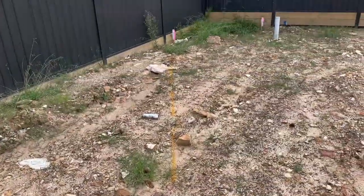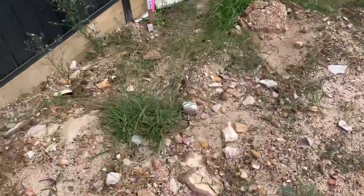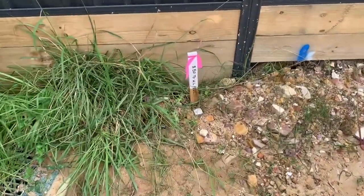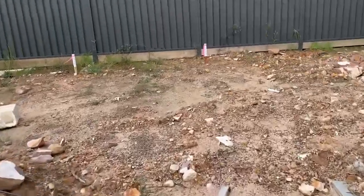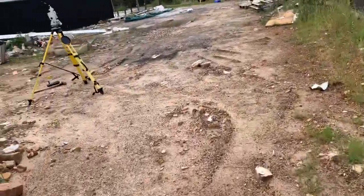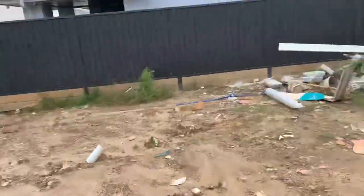I've sprayed the pool line here as best I can — running down over there heading towards the peg and across there — that's the inside water line of the pool. I've got a two-meter peg recovery there and a 3.5-meter peg there, and the 5.5-meter pegs are in as well. That's the pool marked out — time to pack up and head back to the office. Thanks so much for watching everyone; if you enjoyed the video please like and subscribe and stay tuned for more videos from the Global Surveyor.